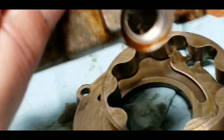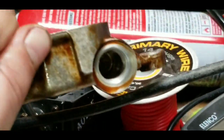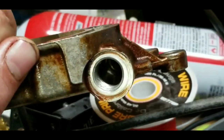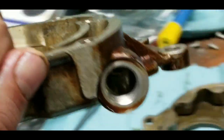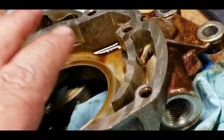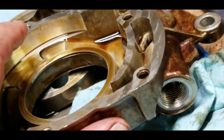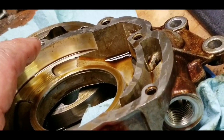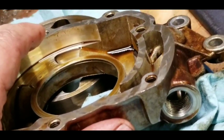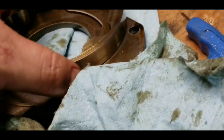I can't get enough light, but there's some similar scarring around the top of that chamber. There's got some metal or trash in there. This engine has had at least one lifter failure and I believe a trunnion failure before I got it, so it's had some debris that's gone through the engine. The cylinders are good but some of the oil passages have shown signs of wear.